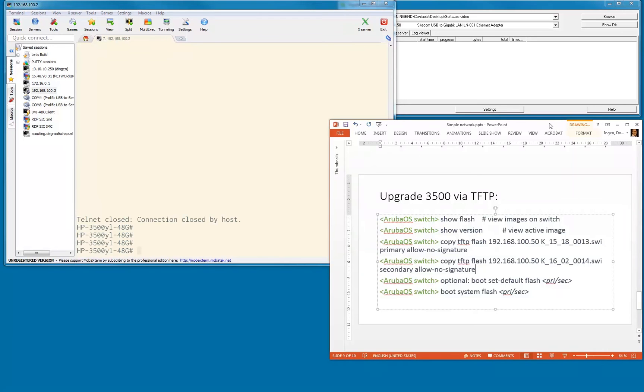This is the end of this video. I hope I showed you three ways to upgrade: the 3810 via USB, the 3500 via TFTP, and the 2920 via the web interface — which can be HTTP or HTTPS depending on your configuration. You can also do this via secure copy or secure FTP. This sets the basics for our infrastructure. We have the management VLAN and all the upgrades done, and now we can move on to configure a real network. Hope you find it useful — please give a thumbs up, subscribe, and leave any questions in the comments. We can safely roll into video 4 of this series.